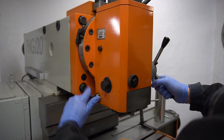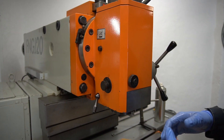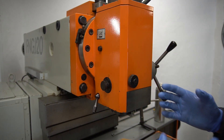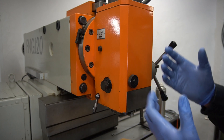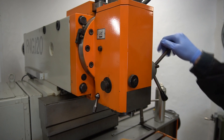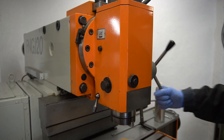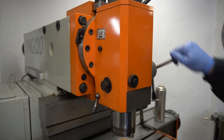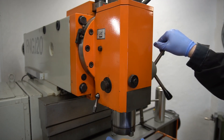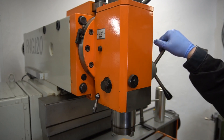This mill has seen very little use. That's why the inside of the quill housing and the quill is almost like brand new, and that's why it feels a little tight when you are removing it and pulling it back together. It bites a little bit when bottoming out. But I think the spring could use a little more tension, especially when using a large tool on the spindle like a big boring head.